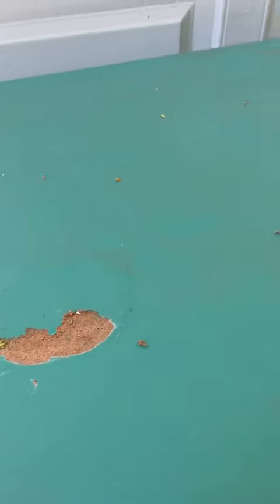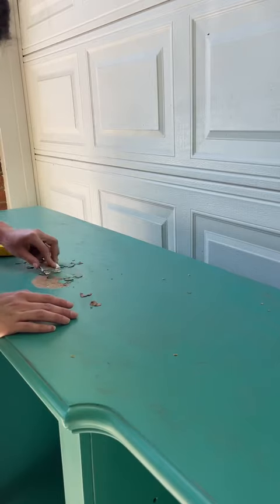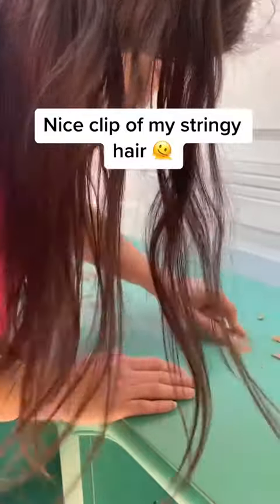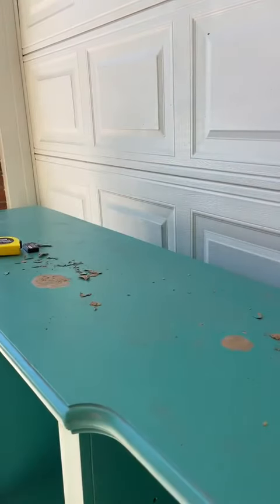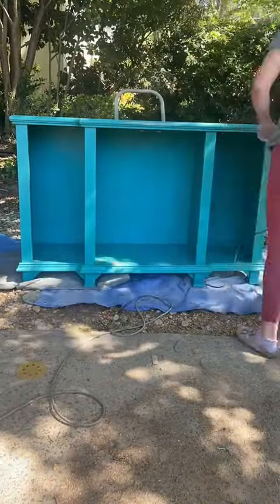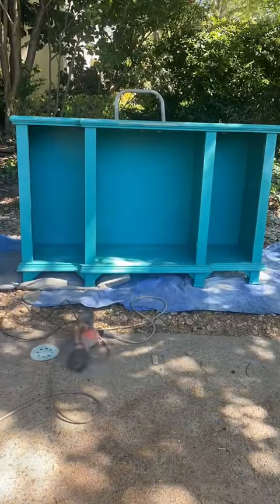If you're dealing with any piece of furniture that's made of any type of pressed wood and you see these swollen areas, that's just where water has been exposed to the wood underneath and the wood has swollen. You can either sand them out or scrape them out. I have this scraper in my hand and I just couldn't resist. Sanding is definitely a safer option — you don't run the risk of making even bigger holes — but just make sure you sand it all the way out so you run your hand over it and it's completely smooth.